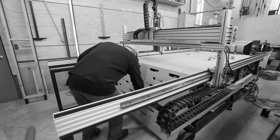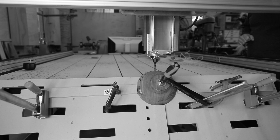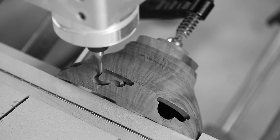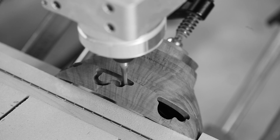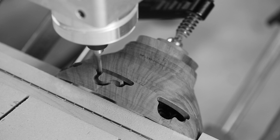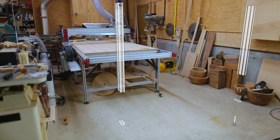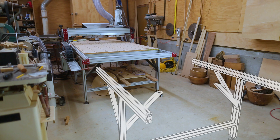On my previous CNC machine I had four feet of extra travel for the gantry, so it was actually a four by twelve foot machine. That extra four feet gave me an area to do a vertical table that was adjustable from 90 degrees to zero degrees from tabletop, so I could work on the ends and the sides of objects.